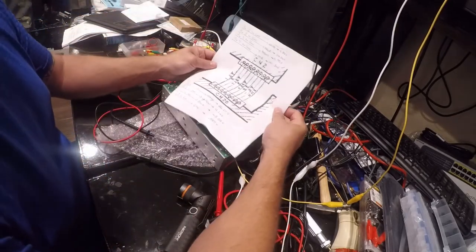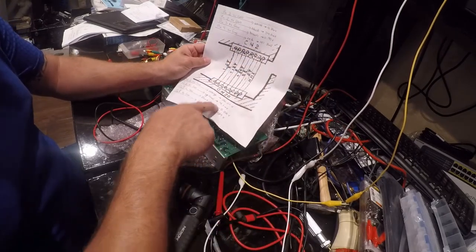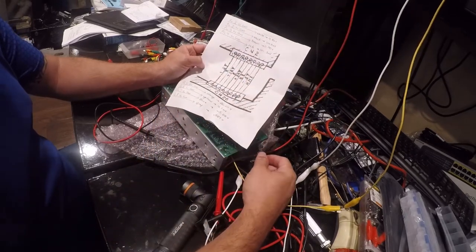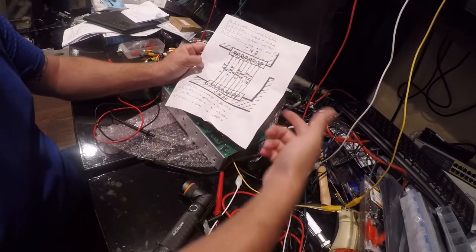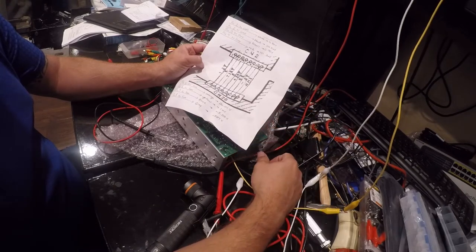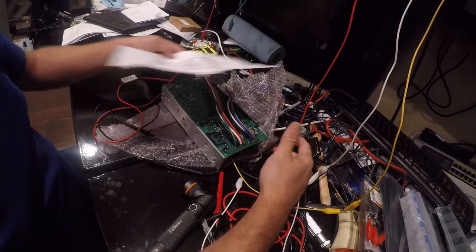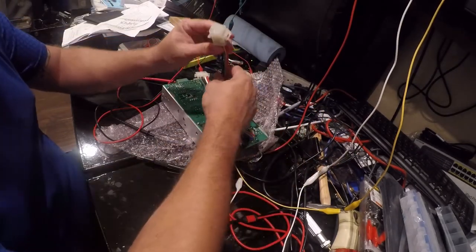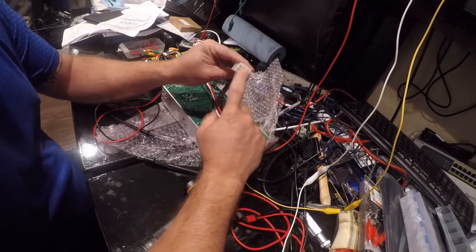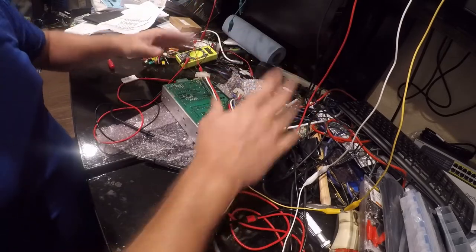And then I've looked at this and I've concluded that we got 5 volts, minus 5 volts, 26 volts, and 12 volts. I have no idea what the heck's going on. Plus and minus 5 is a digital logic level. 12 volts is running the computer, so I think those are my criticals. I don't know what the 26 volts is doing. This is putting out 80 volts AC. That's got to be on the servo side. It's got to be servo drive, so that's fine. We don't need anything to do with that.